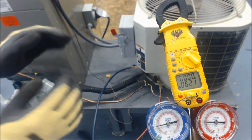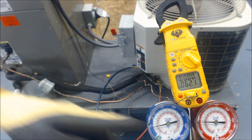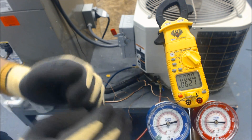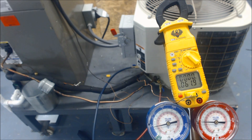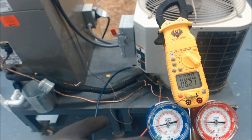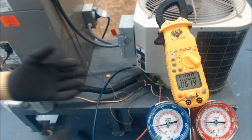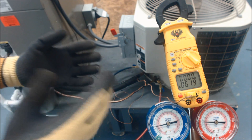In this scenario, I'll give you the superheat and subcooling. For a TXV system, you normally check subcooling using the high-side gauge and the temperature on the liquid line. But correct subcooling alone doesn't mean the whole system is operating correctly. You want to confirm correct charge with an 18 to 21 degree temperature difference between return and supply air. If you're below 32 degrees on the low side gauge, that could indicate an airflow problem, a metering device restriction, or a low refrigerant charge.